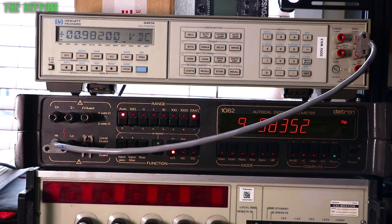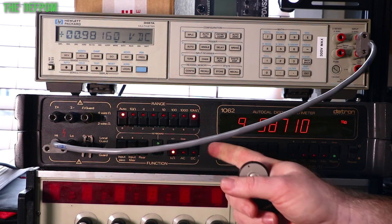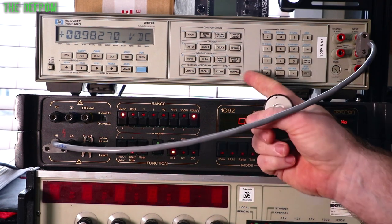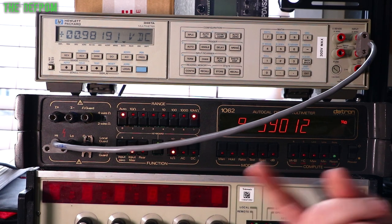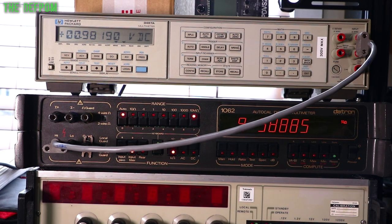Otherwise, you might move that particular piece of gear onto a different meter, which has a very slightly different input impedance, and it will read differently. Like I was getting different readings between 3 meters, between the Datron, the Siglent, and the HP. I was getting 3 different readings. Now, the Siglent was the most well-behaved because that has a bit more of an obvious input thing there. And when I was testing on the bench, I was only testing up to 10 volts, which meant I was only getting at most 1 volt out, which means it was in the ranges where it's staying in gigohms.